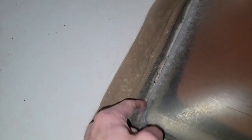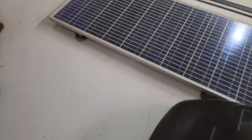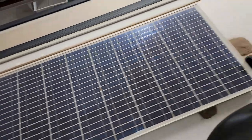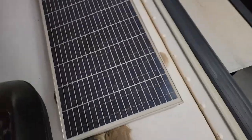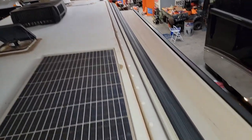Some of these Tiffin skylights have been prone to issues as far as cracking — usually the white obscured ones. We want to check and make sure I don't see any cracks coming up from the base into the lens itself. I'm not seeing anything — sealant's still perfect and intact. We have the mid-coach AC; I'll check it's not loose. The solar panel is a good size — 150 to 160 watt panel maybe. I don't see anything wrong with the installation; sealant looks good.